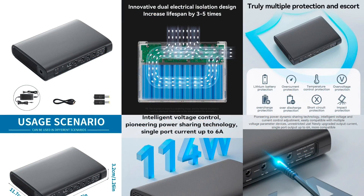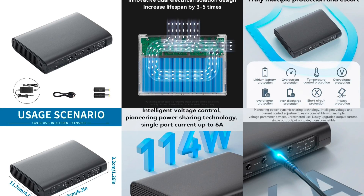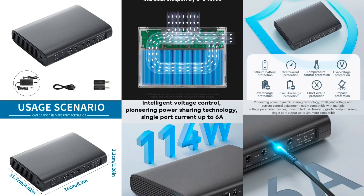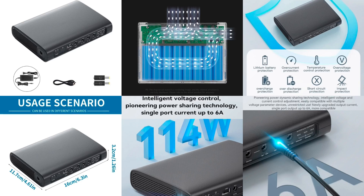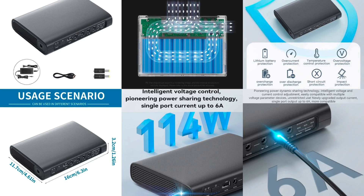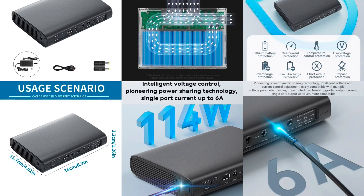The model is the Ruisi MD1 Pro, a DC uninterruptible power supply. It has a declared battery capacity of 25,600 mAh, which is approximately 94.7 Wh. The batteries are lithium-ion, and the output ports include USB at 5 volts up to 2 amps, DC1 also 5 volts up to 2 amps, and DC2, 3, 4 — selectable 9 or 12 volts, up to 2 amps each. When setting the same voltage on multiple outputs, the power is combined and the maximum current on a single port can reach 6 amps. The power supply is external, 19 volts with a current of 6.32 amps and 120 watts. It supports simultaneous charging and pass-through power to the load. Battery protection includes safeguards against deep discharge, overcharge, and overheating.